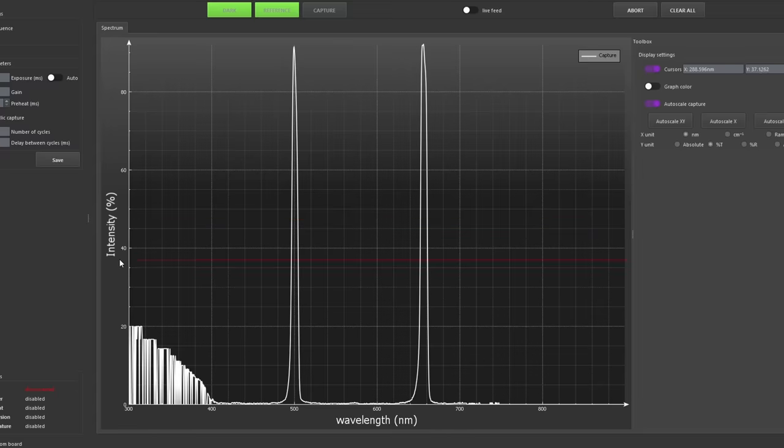Now, as a reminder, with my spectrophotometer, I have some limitations. One, the light that I'm using is not good enough to give any significant results below 400 nanometers, even like 420, something like that, nanometers. So you can completely ignore this part on the left. And also, it's typically not precise enough to measure the actual blocking factor outside of the band passes. So this is something that I cannot check. Although I do see a little wave here that probably makes me think that there's a little bit of not so good blocking here in the center. But yeah, that's probably just a detail.